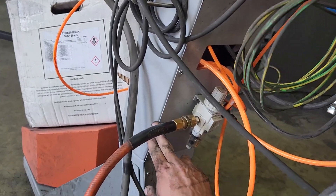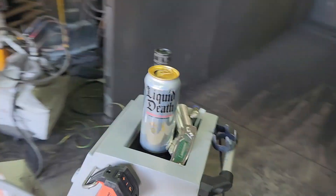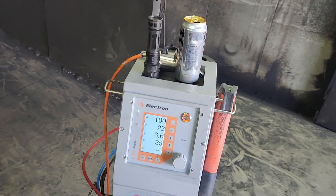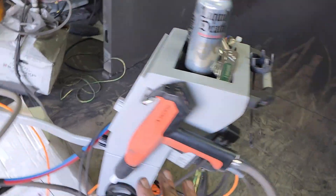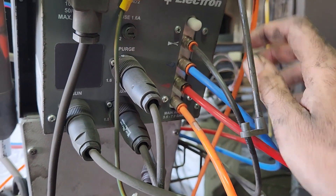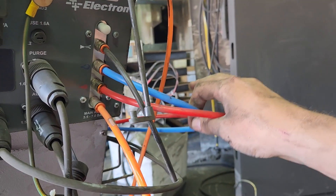So that's as far as air and hoses go. You're going to attach the midsection to the bottom and get all these wires out, then cover it up. On the top unit, before you put in your controller, go ahead and install your gun hanger — there are two bolts on the inside, just tighten them up and wrench them down. Then you can slide your unit in with two screws and that's it. Then you're going to run all your air lines: one for your tip that goes to your gun, a blue line for your supplemental air, and a red line for your main air which creates your venturi. These hoses come very long.